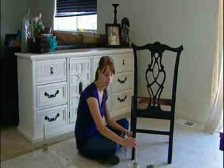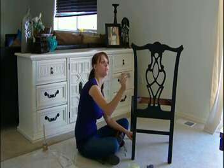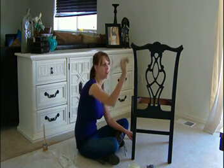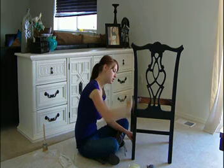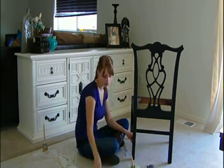Protection finish. When you put on another coat, like if I were to go over one of the coats I just did, you're really just rubbing the old wax in with the new wax. You're not really building up a new finish. It doesn't really work that way with wax. So when people tell you to put 2 or 3 coats on, it's really not doing you any good.